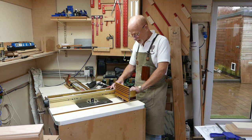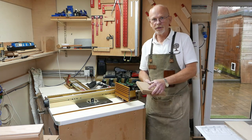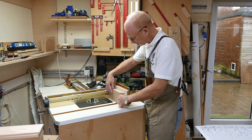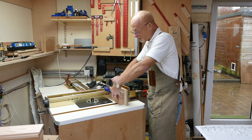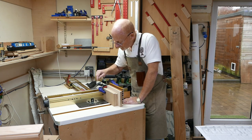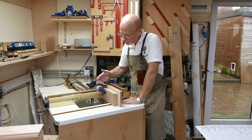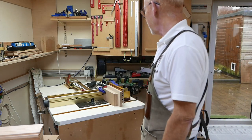I'm going to make any fine adjustments required to get that depth of cut absolutely perfect. I'll get my right angle fence, keep it firmly pressed down on the table, lock it in place and clamp it. I've got a couple of pieces of scrap MDF to make the cuts on, and a piece of scrap ply to use as a backing board to reduce any tearout. I'll keep those firmly pressed down on the table up against the fence and clamp them to the right angle fixture. Then I'll make a single pass with the router bit projecting halfway through the fence at the zero mark, and retract the fence by 28mm as indicated on the template.